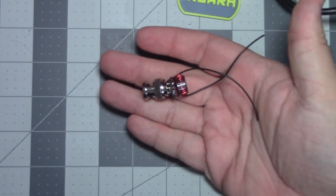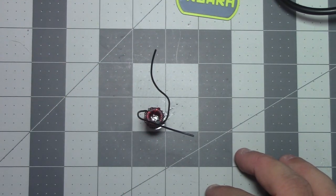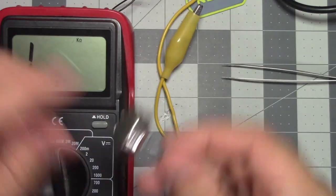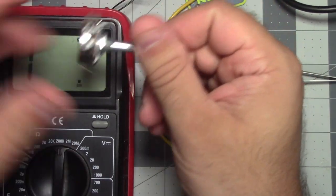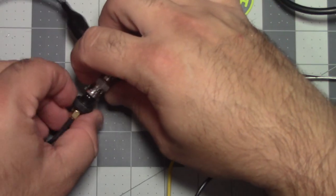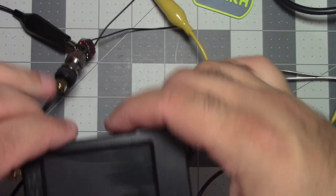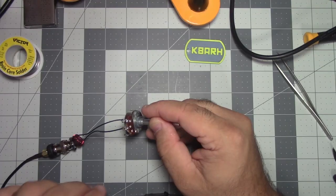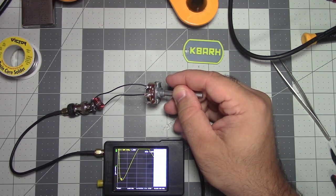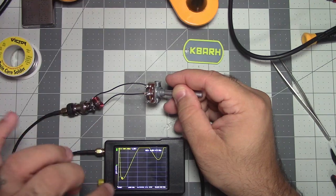Now all we have to do is supply our wire and our counterpoise. Now it says to test this, we need to place a 2400 ohm resistor between the antenna wire and ground. I don't think I have a 2400 ohm resistor, so I'm just going to use this pot. Okay, well, it's pretty close. Okay. We are connected. So I figured it out. Apparently I had accidentally hit pause sweep. I went back to double check my settings.